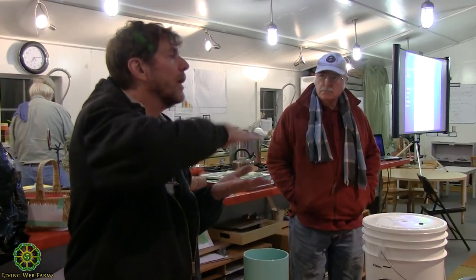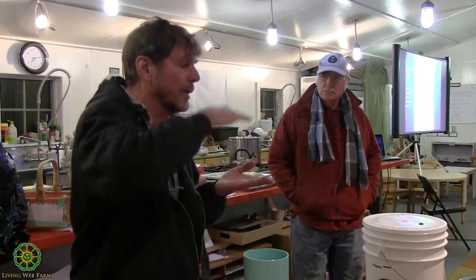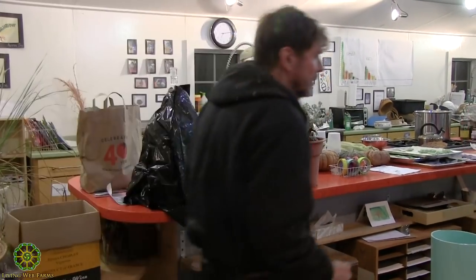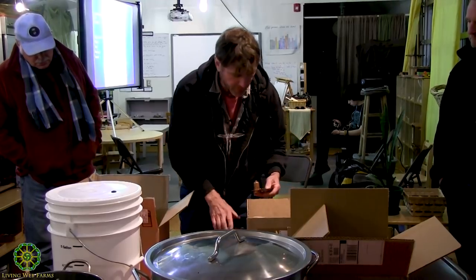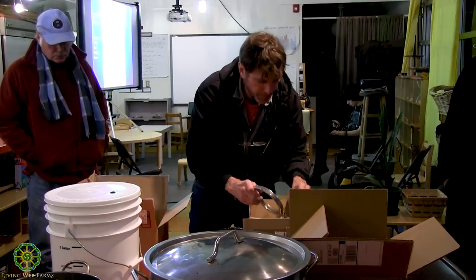With a large column on a small still, there's less liquid they have to control through the process. At each level — I think the one we were talking about had four steps — each level has to be very meticulously controlled so it can't overflow and it can't under-flood; it has to always be wet. The more efficient still is a bubble plate design.